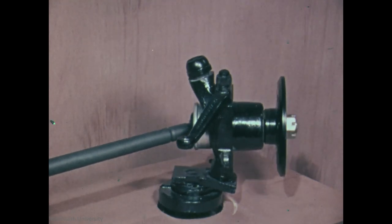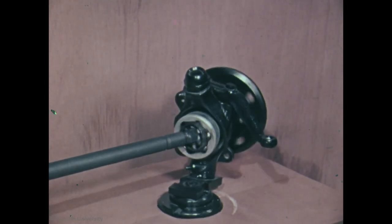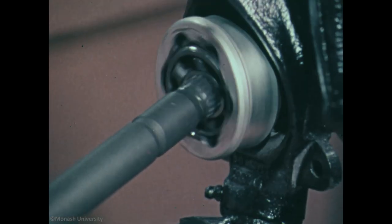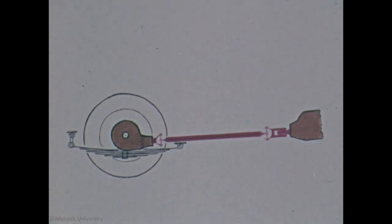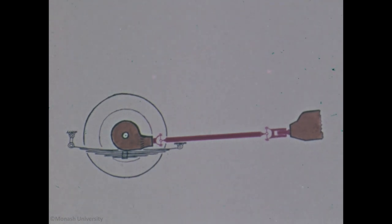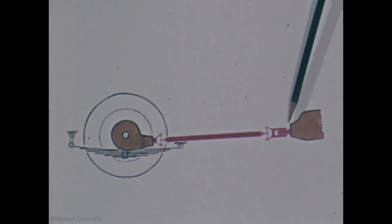The transmission elements must be supported by the shafts themselves. Then they constitute a shaft coupling, which for uniform speed transmission is by common usage called a constant velocity shaft coupling. A well-known example where uniform speed has to be transmitted fairly accurately is between the steadily rotating gearbox output in a car and the hopefully steadily driven rear wheels. Because the rear axle is on springs, there's some uncertainty about its position relative to the gearbox. Usually there's a multiple coupling in the form of two universal joints and a spline.